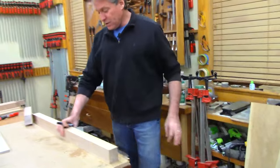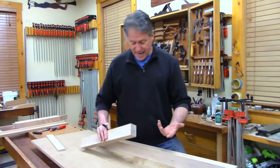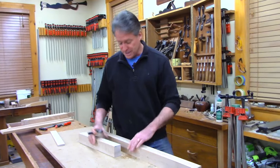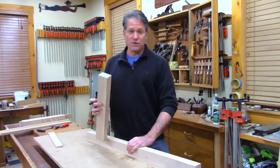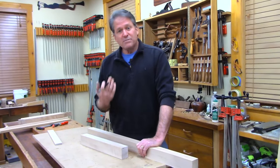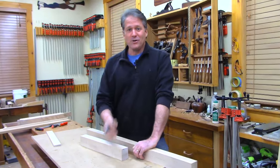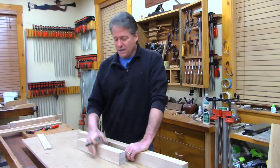I'm just gonna demo quickly a way to go about it, let's say you didn't have the 2-inch material, but you had something like this. I can make another pizza peel out of this. This is soft maple, curly soft maple. It's still pretty hard, but what I ended up wanting, I wanted the flame birch because of its hardness on the Janka hardness scale. If you want to nerd out sometime, look up the Janka hardness scale, J-A-N-K-A.